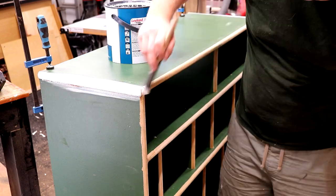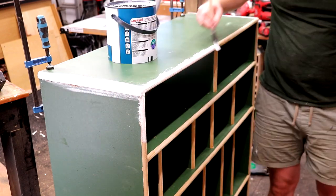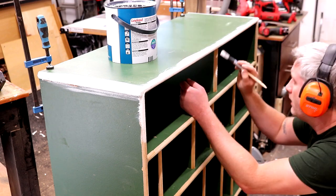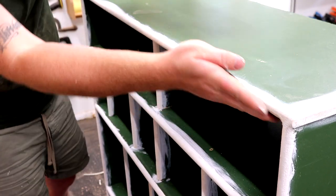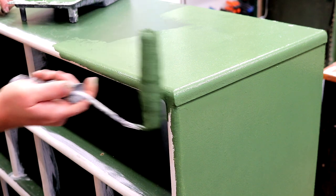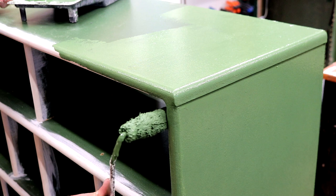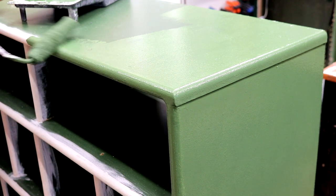Then I get the edges primed with some acrylic primer. I know a lot of people have issues painting MDF edges and they come up with all sorts of crazy ideas on how to do it, but it's actually really simple. First use a good primer, then de-nib until smooth — I'm using 240 grit for that — and then paint, and that's it done. I didn't spend too much time on this trying to get it crazy smooth as this is a workshop project, but you can get it incredibly smooth if you put a little more effort in.